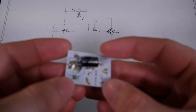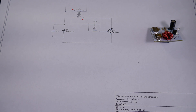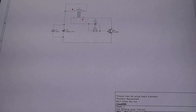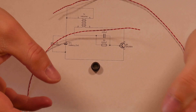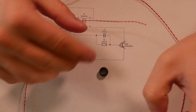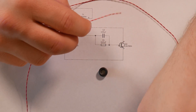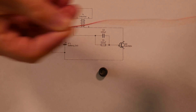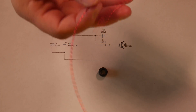That's why this big 470 microfarad capacitor is just kind of bodged on the back across the power and ground of the button cell. It's labeled as 100 microfarads on the board because anything over about 100 microfarads is going to work just fine. Now I'll go ahead and roll the footage of me building this. Step one is to build the transformer — or technically I believe it would fall under the category of inductor. We're going to take our toroid and the magnet wire. This magnet wire is actually two strands twisted together. The way I do that is to take a section of magnet wire, fold the end over, put one end in a cordless drill, hold the other end with pliers, and just twist it together to get a nice tight spiral.